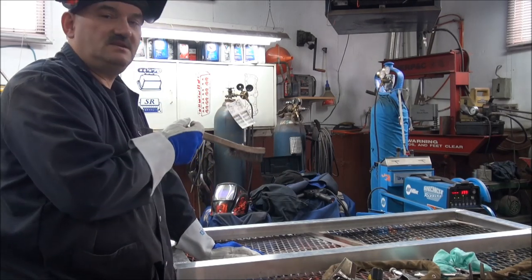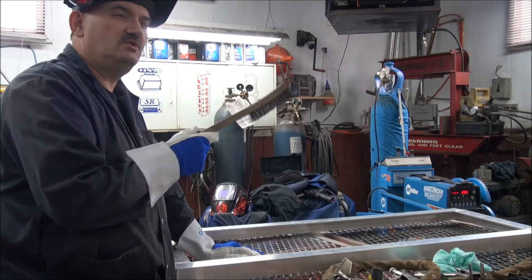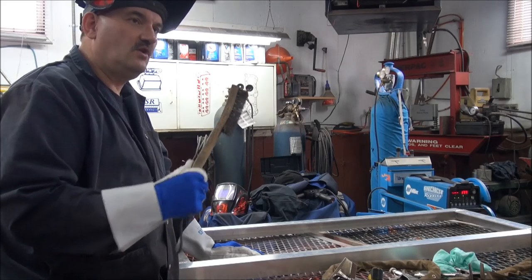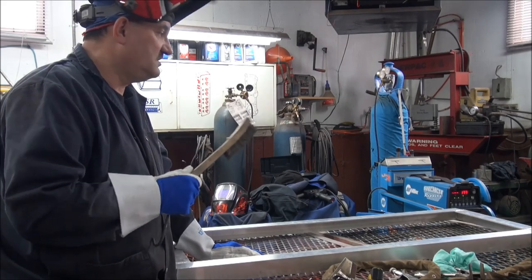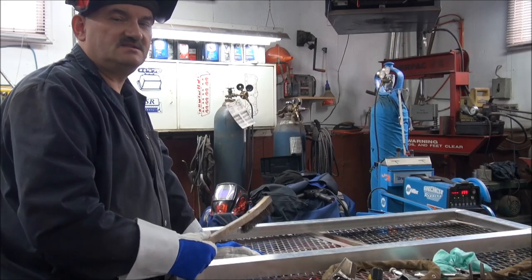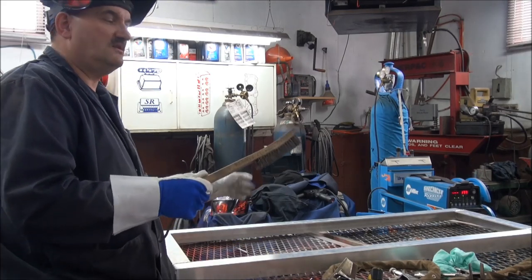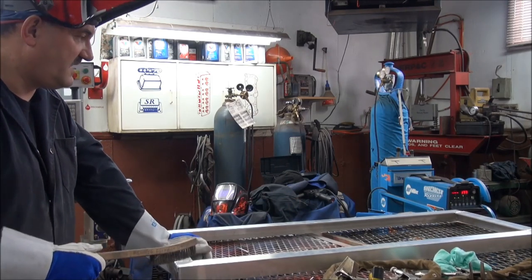Now, the Dynasty DX200, they say it's good up to a quarter inch. I've used heavier metals, but I tend to go towards a spool gun if I get higher than 3/8 of an inch. So that's the reason why I kind of like using the Dynasty on this today. It's kind of a nice system, and it's fairly clean, and it's nice when you see the finished welds.